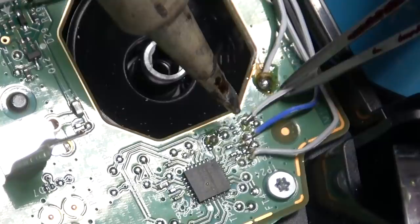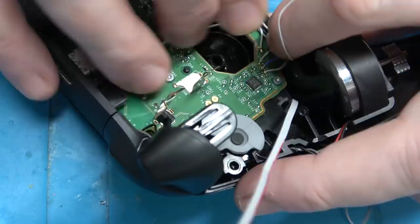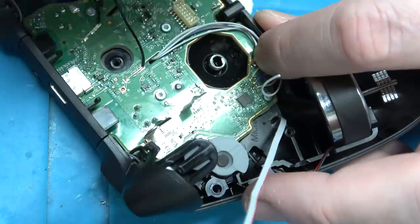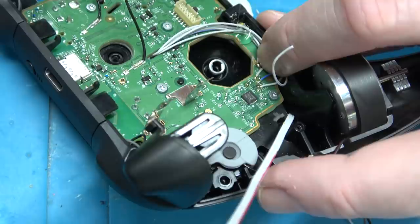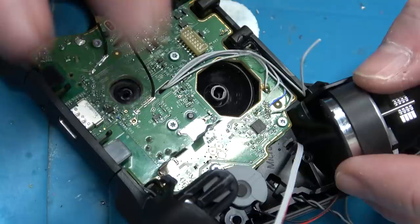You have to use the memory of the wire. Take the wire, move it further than it needs to go — see how the wire is angled down? When I touch it that way, I know the tip of the wire is pointing right down into the solder blob, which helps me get a good connection. Knowing how solder flows and reacts is one of the most important things about soldering, and it's the same thing with wires.